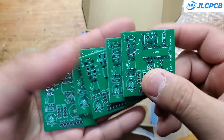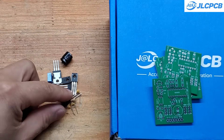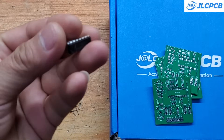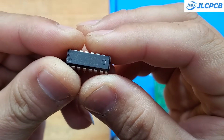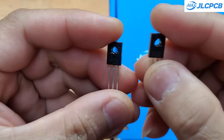As you can see, this project uses a widely popular IC, the SG3525. It requires very few external components to operate. I've adjusted the dead time to reshape the SG3525's square wave into a modified sine wave. So despite being a budget-friendly project, you can confidently use it with any type of load.